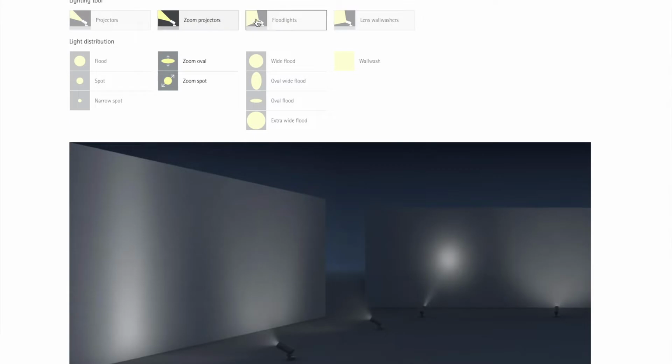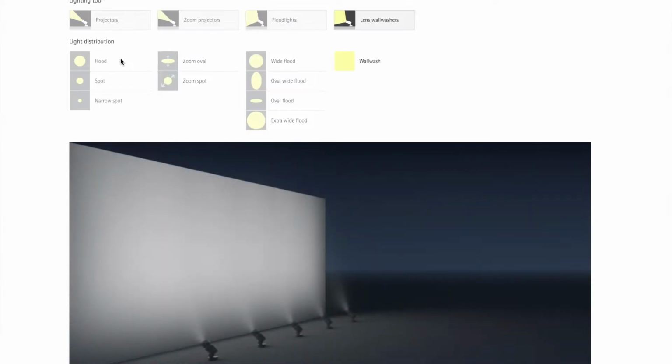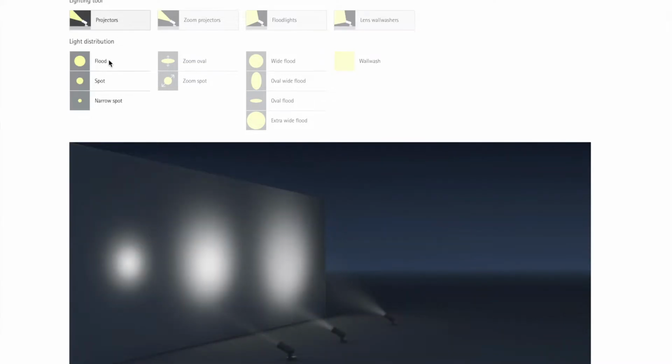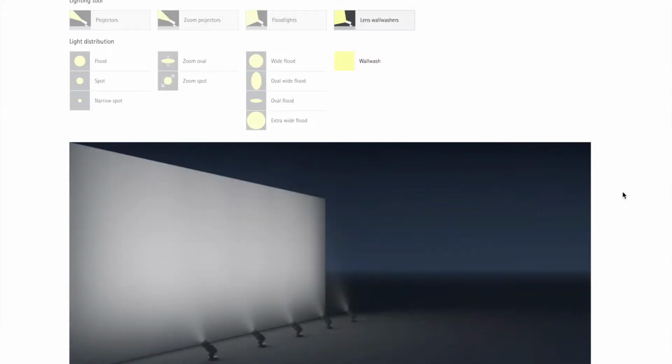Should also mention that in this larger size that's currently available, we go all the way up to 2600 lumens out of that package. Lumens are not necessarily a super important metric when we're talking about a floodlight or an accent light, because of course center beam candle power is going to be more important, but that's the horsepower you're working with. The optics are what's going to drive that light. The narrowest distribution is 5 degrees, and we get all the way up to an 84-degree flood. That doesn't count your oval linear shapes, as well as your wall washer.